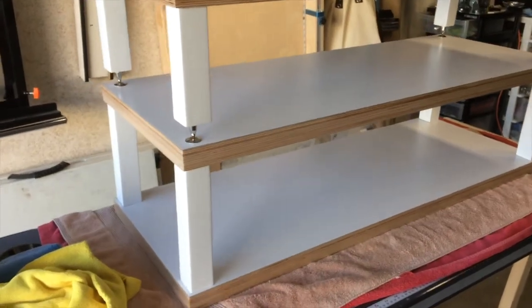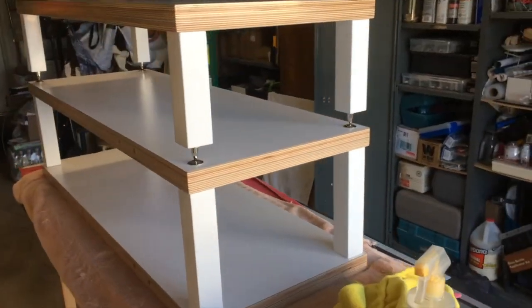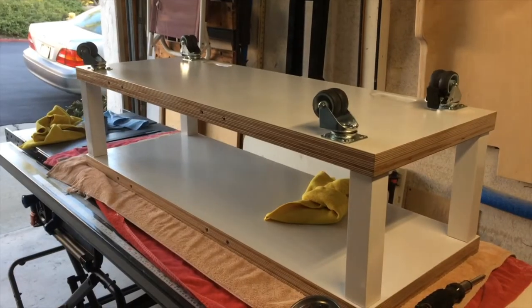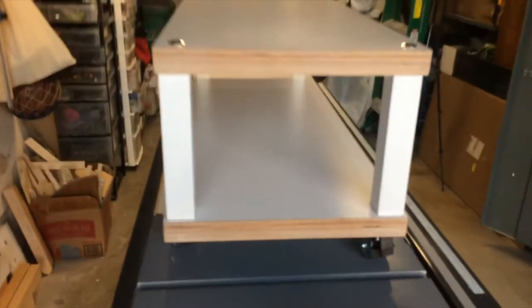The equipment shelves are almost done and I'm quite happy with the way they turned out — definitely a lot better than the IKEA shelves I'm replacing. The double plywood will help minimize any bowing in the middle; they're 43 inches long so they're quite long, sturdy, and heavy. I chose double wheel casters because I have carpet and figured they'd roll better than single wheels, which might dig in too much. Two of the wheels have brakes. This part of the shelving unit weighs about 60 pounds.